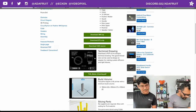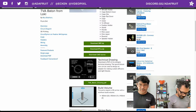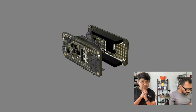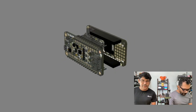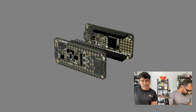There's a technical drawing for the guard screw threading and the light holder, so you can play around with that if you want to make an adapter. The files are available as STLs and 3MF, and you can also download the CAD source in STEP file format or the actual Fusion 360 file, which has all the parts. We also have 3D models for the Feather M4 and Prop Maker Featherwing available in the GitHub repo - they're one-to-one accurate, pre-populated with components and connectors, so you can have a really good accurate model when designing props.